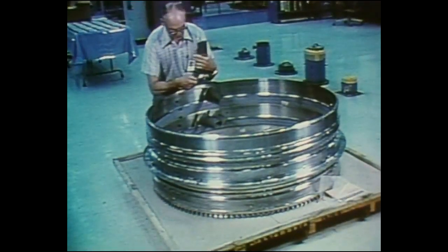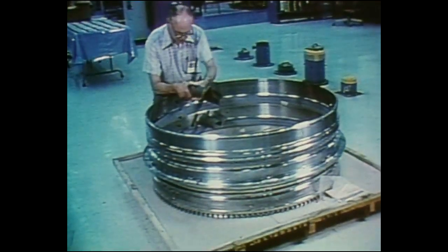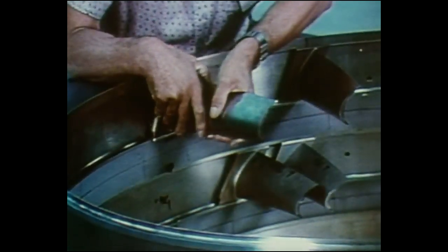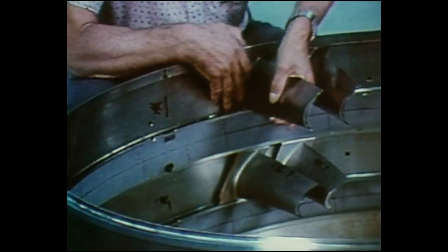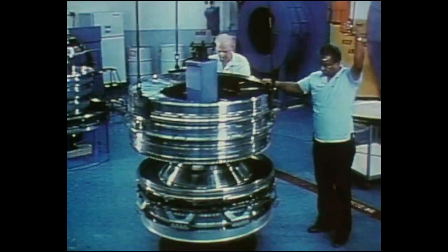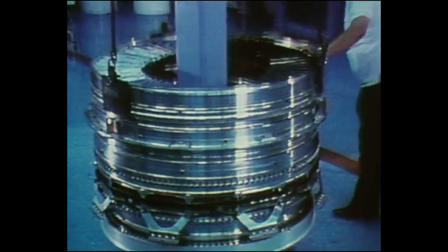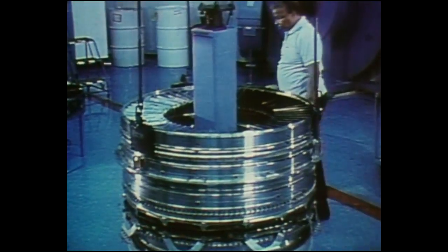The power turbine has two rotors. One is called the forward or outer rotor. The other is the aft or inner rotor. Each has six rows of blades. In a conventional power turbine, the forward turbine rotor would be stationary and simply guide the air into the rotating stage.